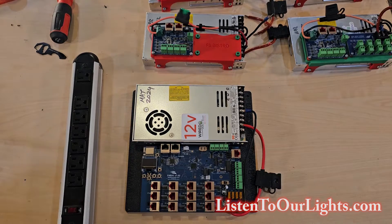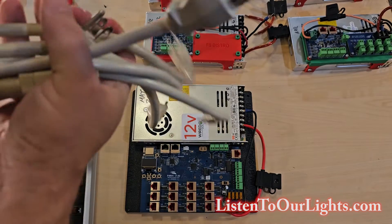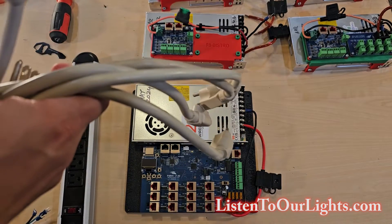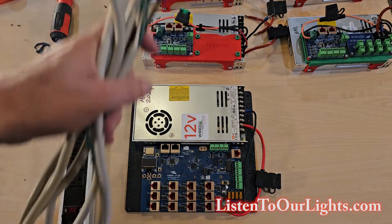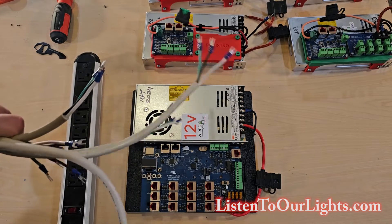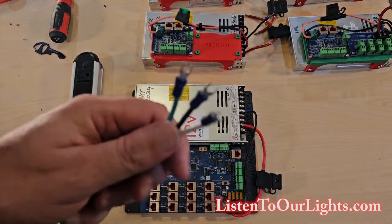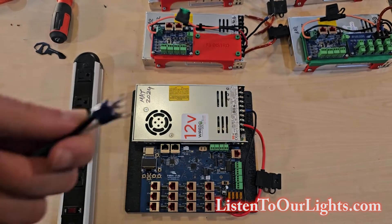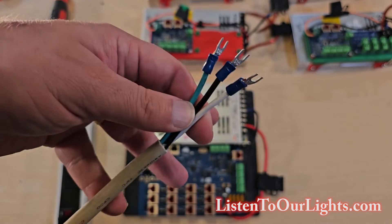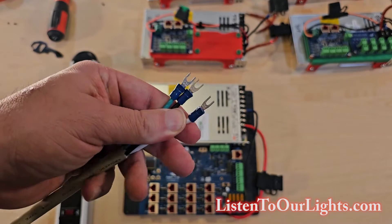Getting ready for my distributed Pixel Falcon network, I made a whole bunch of power cords — seven of them. I like the big chunky ones. At work, we had a bunch of power supplies that had actually been recalled for fire, so they replaced a bunch of them. Before we threw them out, I harvested the cords because they're nice, big, chunky, thick gauge wire cords — perfect for this type of thing. What I did is I cut off the ends in the paper chopper, used the wire stripper to cut off the exterior casing, stripped off the ends, and then put these spades on the ends.